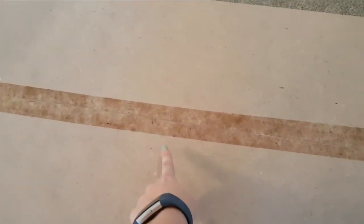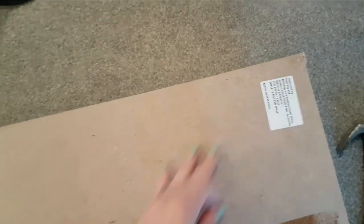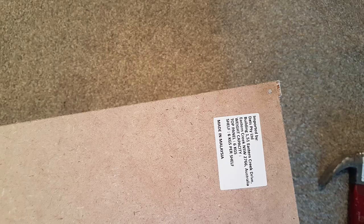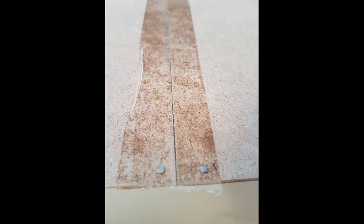You only want to put nails on the edges, not in the middle. I started with the top left corner and the bottom right corner, then did the other two corners, and then I'll show you where else. Once you've got the first two nails in, make sure you're happy with the positioning of the board because it's pretty much tacked down and you won't be able to move it. I did the four corners first with yellow stars marked, then the pink stars, and lastly the green stars — that was 16 nails total. It probably doesn't matter if you use a few less as long as you evenly space them and make sure you do the corners. The reason I did two nails in the middle is because it was two pieces of backboard there.